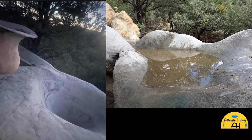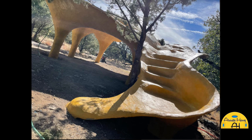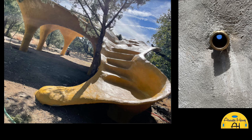Do you have a channeling system to divert water to one side of the structure or the other? Yeah, it comes out on the back of this staircase. All the water that overflows from each of the gardens, it has a 3/4 inch brass connection that works as a clean out and drain, and you can interface all of your plumbing features that might say heat the water or aerate the water or move the water, but you can just open it up and use it as a drain as well. That's right at the bottom of the funnel, and those don't leak.